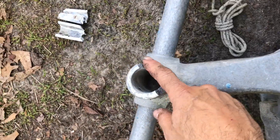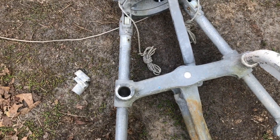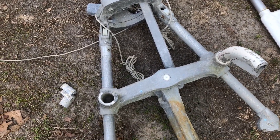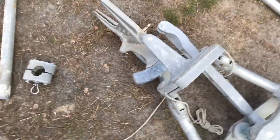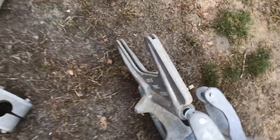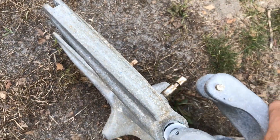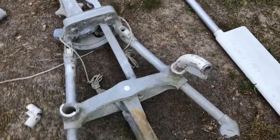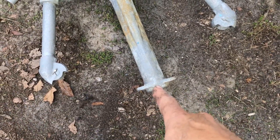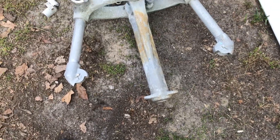Part of the casting here, just the edge broke off — I think that should be okay. I had to cut the remains of a pipe that was in there. I'm going to have to build a whole new mounting for it to go on the transom around the rudder. I need to replace some bushings in here. The bearings are missing on that side, and the universal joint is also missing. I'll probably replace the other side with a universal joint as well. The piece that connects the bottom to the rudder is missing — there's actually two different types: a breakaway and a folding type. I'm planning on getting the folding type.